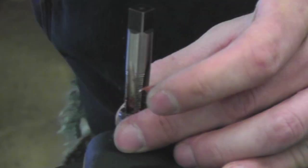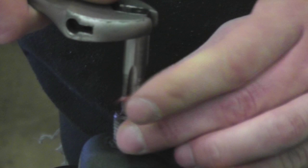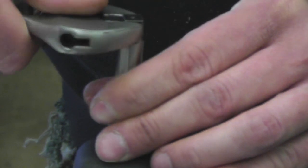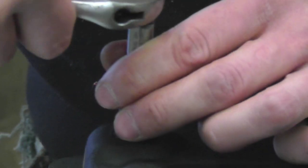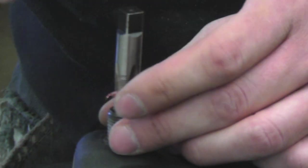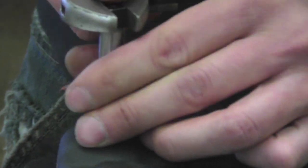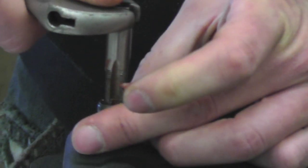So, keep going in some. Again, you want to go about halfway in, because if it's going too deep it's going to bottom out — it's not going to get tight. And you also run the risk of cracking this or breaking off the tap in there, and then it's going to be near impossible to get that out. It's got real hardened steel in there. Go in again to about halfway. And then you can always take it back out and check and look and see about how deep these threads are.